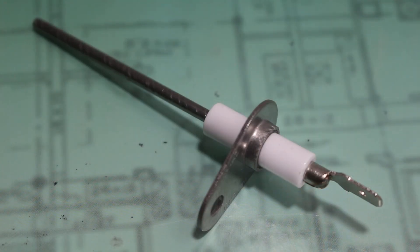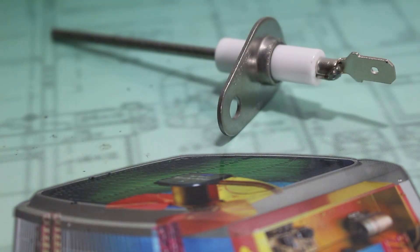So what is a flame sensor? A flame sensor is a specialized safety component that is located inside of the burner assembly of a furnace. It detects and confirms whether or not there is a flame burning inside of the furnace. If no flame is detected, the furnace flame sensor will shut off the furnace in order to avoid a potentially harmful gas leak into the space. This is beneficial in preventing carbon monoxide poisoning to occupants and preventing possible explosions.